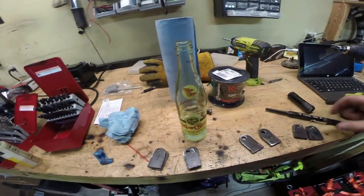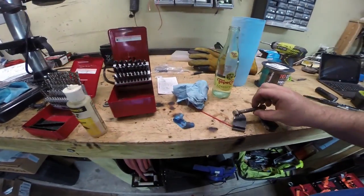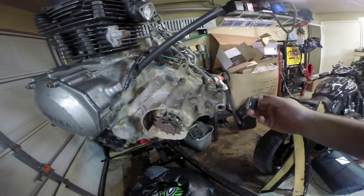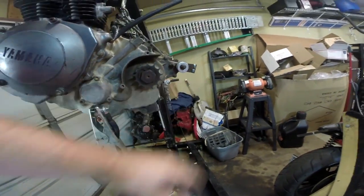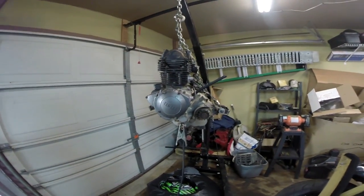The next step for the golf cart was to make these little quarter-inch steel tabs. The holes I drilled and chamfered are going to be for these engine mounting bolts. What's going to happen is these guys are going to mount here, a second one's going to mount on the other side, and we're going to bolt them on. Then we're going to weld a piece of steel backwards back here across the back, which will allow us to build the frame for the cradle in which the engine's going to sit. The next step is to go piece by piece and cut little backing plates for these and then weld them on. There are all our little arms, and we're going to build a sled out of box tubing that will help protect our engine from underneath as well as provide a structure for us to mount to.